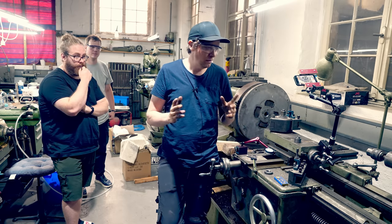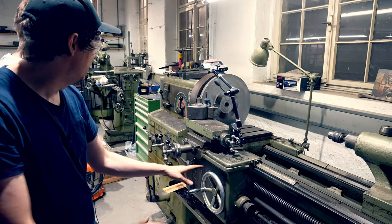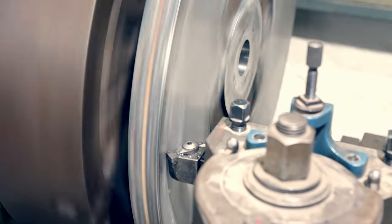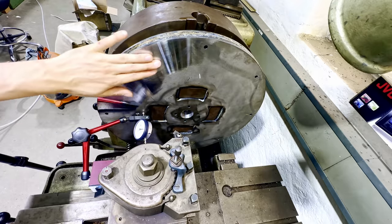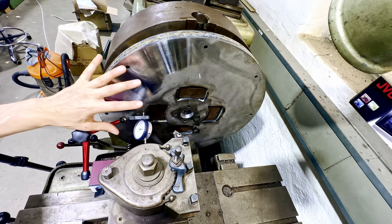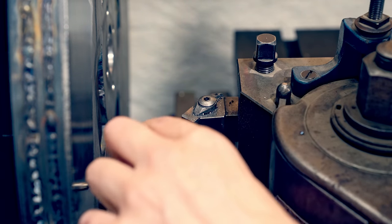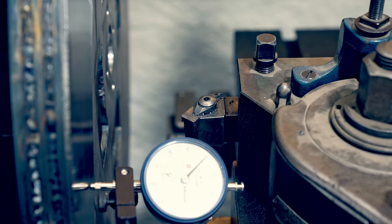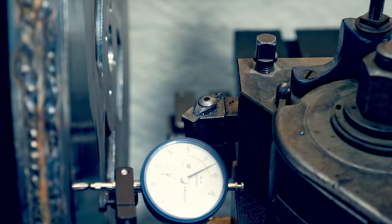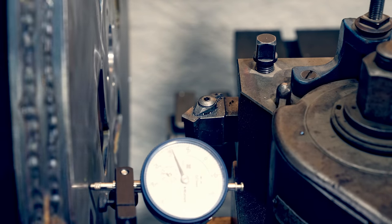So I actually won't be able to finish the job today. Welcome to day eight of the flywheel. We're doing a powered cut for the first time ever — the machine is doing it automatically. We're face cutting the whole flywheel. In the first pass we touched only up here and the surface looks really really nice. But now I want to set it up so I only have to make one single more cut for the whole face. To set the depth of the final cut I'm going to zero the indicator here and then search for the lowest spot on the plate, so I know how much material we need to take away.